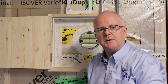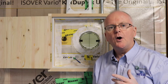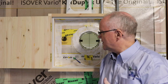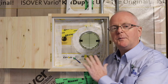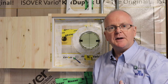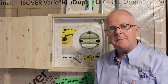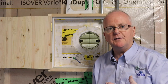A lot of us have an arrangement like this, what's called a background ventilator or hole in the wall for ventilation. It's a very crude system — there's a pipe in the wall, a grill on the outside to stop insects coming in, and normally a grill on the inside as well. That's effectively how the vast majority of people get fresh air into their homes. But there are new systems now which give you the same amount of fresh air but actually improve comfort and general quality of life in the home.